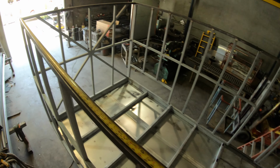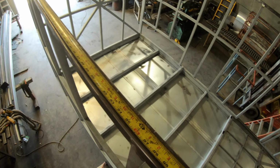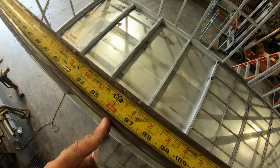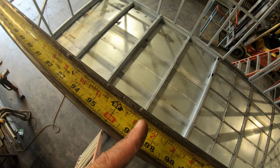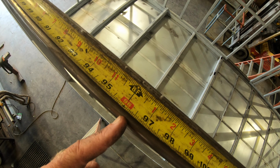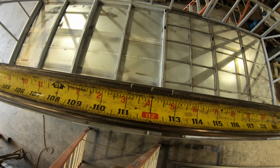Laying out the roof plan here. So you measure up on the big ladder. And we're marking sheets of plywood centers. Got 1¾-inch tubing. Center there. So this is going to end the sheet of plywood. 16-inch on center roof joists.